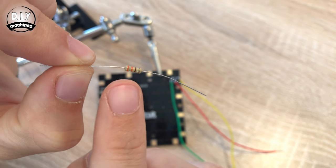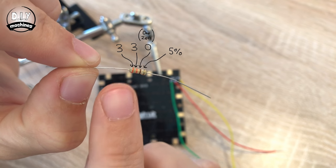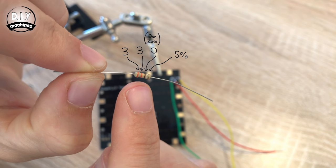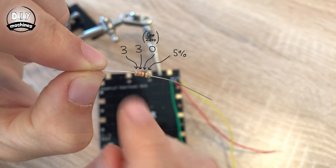Now you've completed the first bit, we'll need to add our resistor next. This is a 330 ohm resistor — orange, orange and brown bands, which gives us 330 ohms of resistance. The gold band at the end represents how accurate or precise this resistor is, which is absolutely fine for what we're doing. This needs to be connected to our digital in wire — the yellow one. This helps protect the NeoMatrix when you start up your project in case you have any electrical surge, which could damage the NeoPixels. The legs on this are quite long so we'll just trim those off a bit.